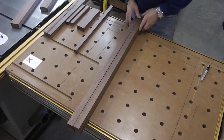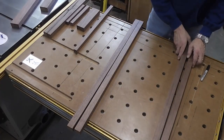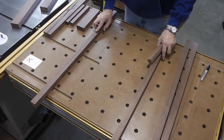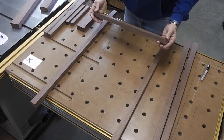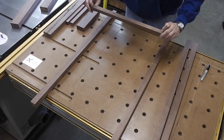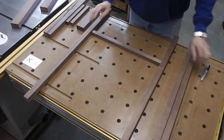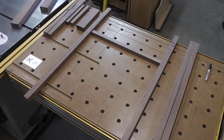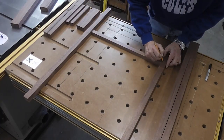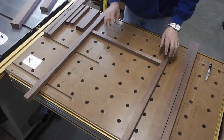On top of them I'm going to put a triangle on the end and mark which one's going to the front. Now that I've got the legs figured out where they're going to go, I'll take the front legs and set them aside. There's going to be a stretcher that goes between the two back legs — that's this piece right here. I want the edge grain to show forward, but I also want a good piece up on top — that'll be the show face.